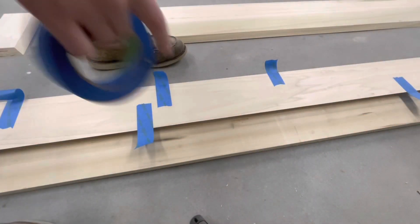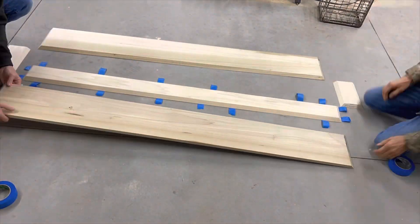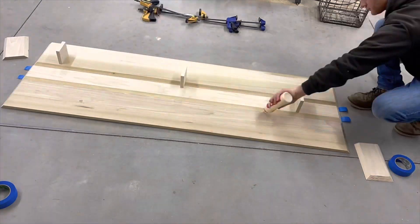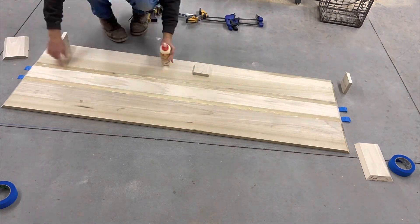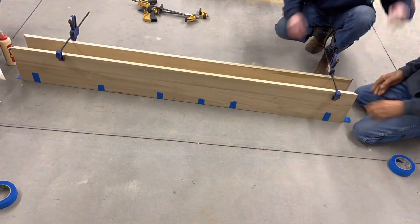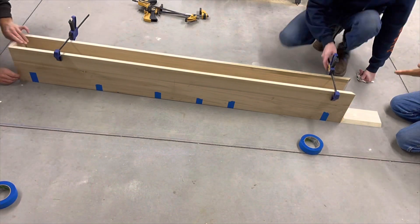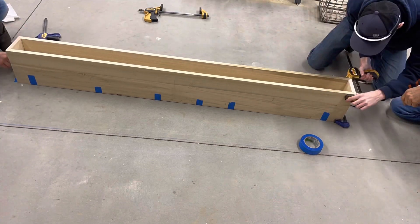With all the pieces cut to size and the angles cut in the correct spot, it's time for the glue up. I suggest using blue tape to do the majority of the clamping - a few actual clamps will be good to have, but I mainly use tape to hold this together. I put tape across the seams on the show face of the wood, which allows everything to fold together, bringing both 45-degree angles together and creating a 90-degree angle to form the rectangular shape of the mantel. I did cut some spacers to put in the middle to keep things square and supported during the glue up, and an extra set of hands was nice for making this a success.